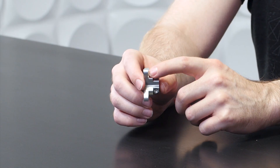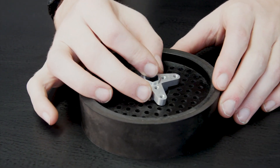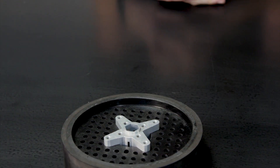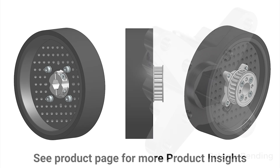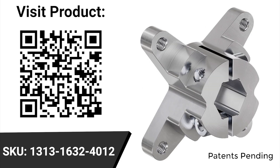One really killer feature about this hub style is the 32 millimeter diameter shoulders on the back of these arms. That allows you to nestle this down into a wheel, a gear, a pulley — anything that's got a 32 millimeter bore. If you're supporting load, with load pulling it to the side or load going down because it's a wheel, that load is going directly through those shoulders into the hub, down into the shaft. It's all very sturdy, and it puts your center of rotation right in the middle of whatever it is you're mounting, so you're not mounting the hub off to the side and introducing a moment arm.